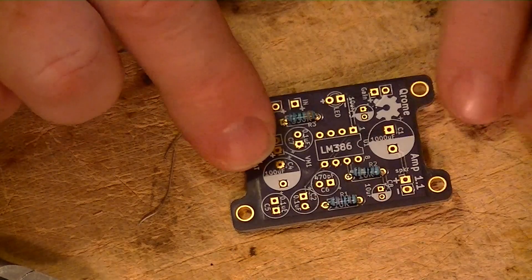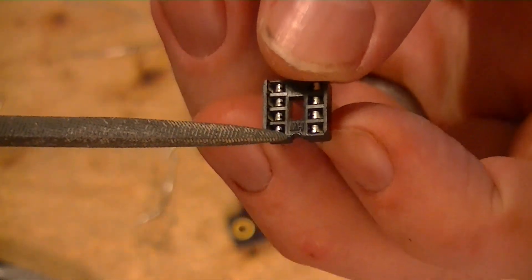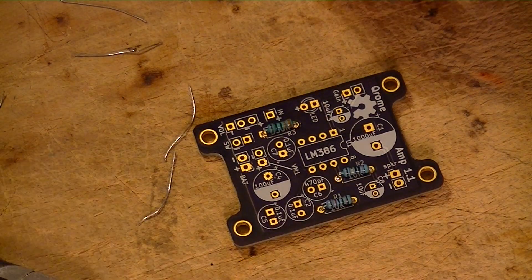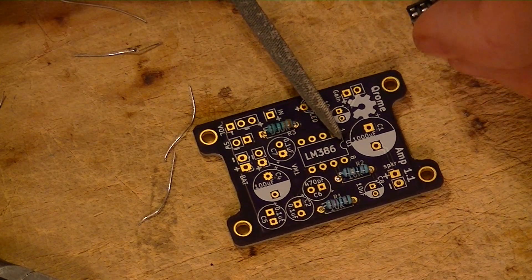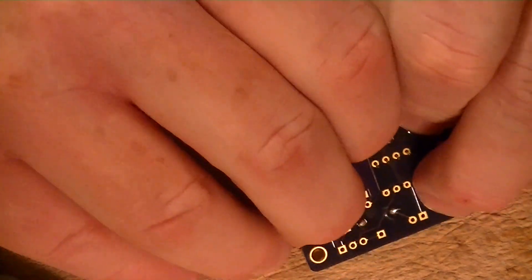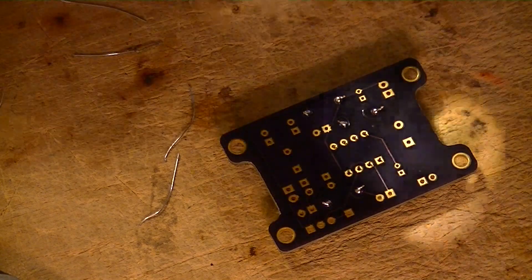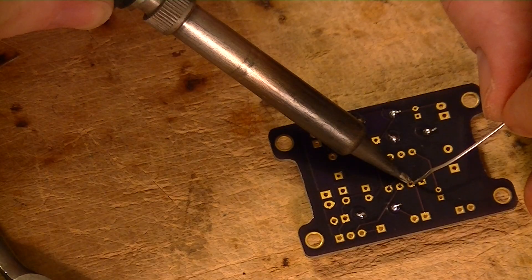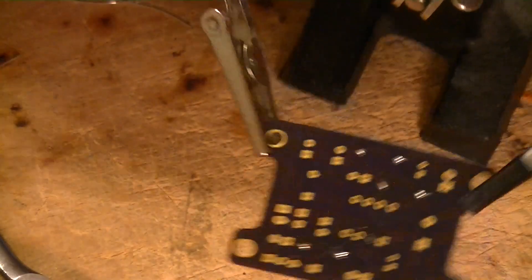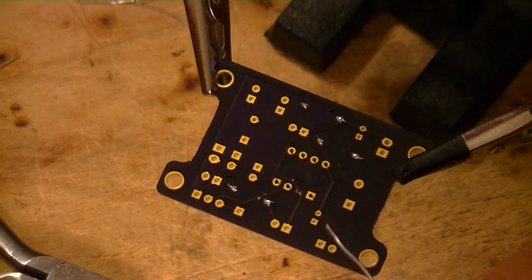Okay, we got the resistors done. Now I like to do the chip socket. This right here is the top of the board — you don't have the same groove on the bottom. You can see the same design on the board that you just match on the chip. Lay it on the solder board, then verify that all the pins are sticking out and that you didn't bend any under. Looks good. What I did there is I got one pin to attach it, and then just go through the others — a little bit easier.